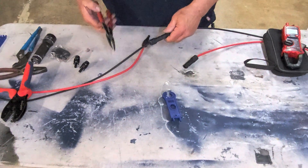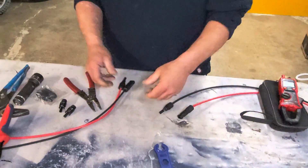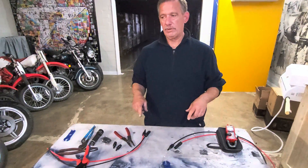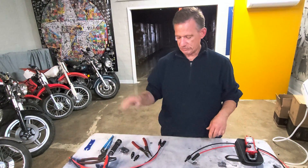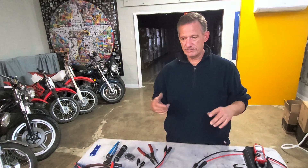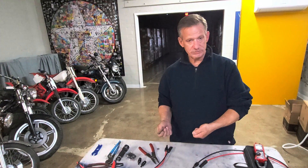You can measure DC voltage coming to your array on the positive and negative wires — the voltage depends on how many panels and whether they're hooked up in series or parallel. But if you have a bad connection somewhere between here and the solar panel, you can still measure voltage. As soon as you put a load on it, the voltage will drop out because it's barely touching and the load itself pushes the contact points apart.